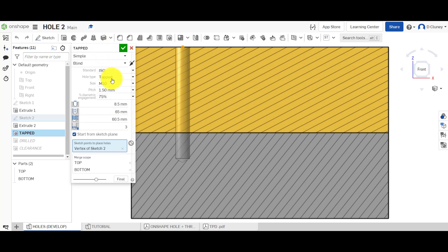So what we're going to look at now is a tapped hole. Once you've selected and placed where you want this hole to go, and decided which parts it's going to be applied to, you can then choose tapped. Depending on the standard you've chosen — I've chosen ISO — you get a few options. You can decide on what metric size you want: M12, M8, M6, M10, for example. Depending on the standard and size chosen, you'll have options for the pitch — in this case 1mm, 1.25, and 1.5 — which is the coarseness of the thread being created.